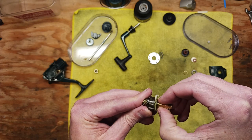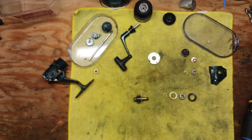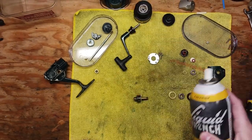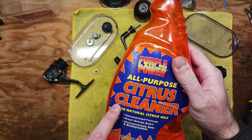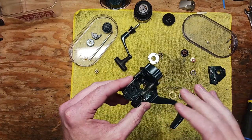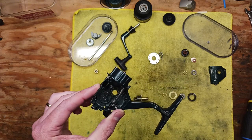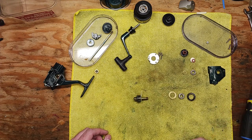I'm going to snap that back on so I don't lose any of those pieces and parts. That's what this video is about — pointing those things out to you. Now when it comes to cleaning: penetrating oil is really important. Spray down all these pieces and parts with that. I spent a great deal of time with Purple Power citrus cleaner degreaser, cleaning out the housing and getting all that wax and gum out of there. You need to take the time to do the cleaning if you want smooth operation.